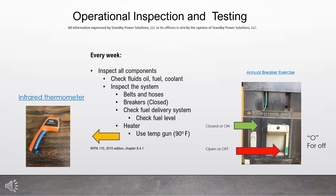The engine is equipped with a coolant heater. This is an electric heater intended to keep the coolant at a warm enough temperature to start the engine even in the worst conditions. We like to see that temperature around 90 degrees Fahrenheit, no matter how cold it is outside. You can get an infrared thermometer like the one pictured to the left — they're fairly inexpensive and available in a lot of different locations.